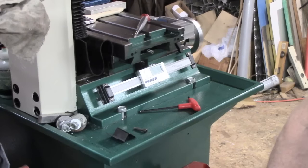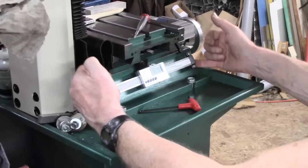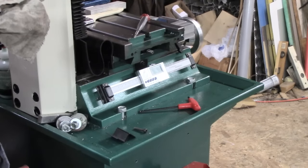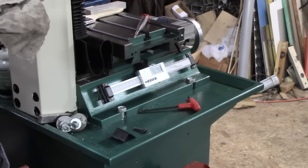I mentioned before about this big slab of aluminum bar, which seems pretty pointless actually. I was going to fit that first and then fit this to it. What I need really is two spacers, and I've measured as accurately as I can by various methods, and I'm just about to get on the lathe and make a spacer button for each end. The measurements at the moment come out at 600 thou, pretty much close to it. So I'm going to make them at 600. I can always shim with a washer, or if they're a little bit too fat, just machine a little bit off.